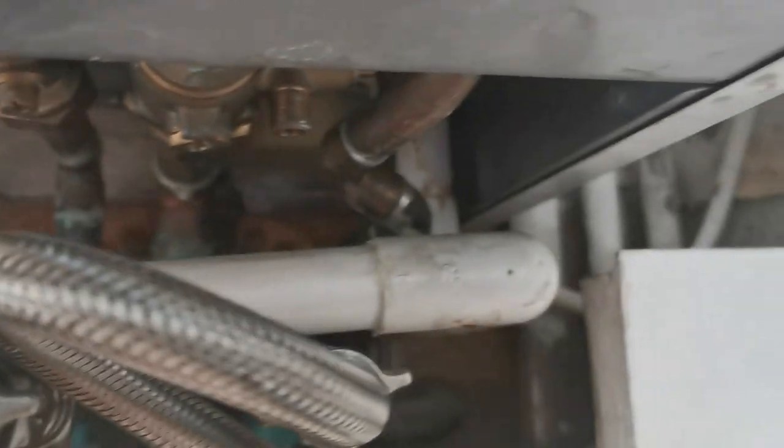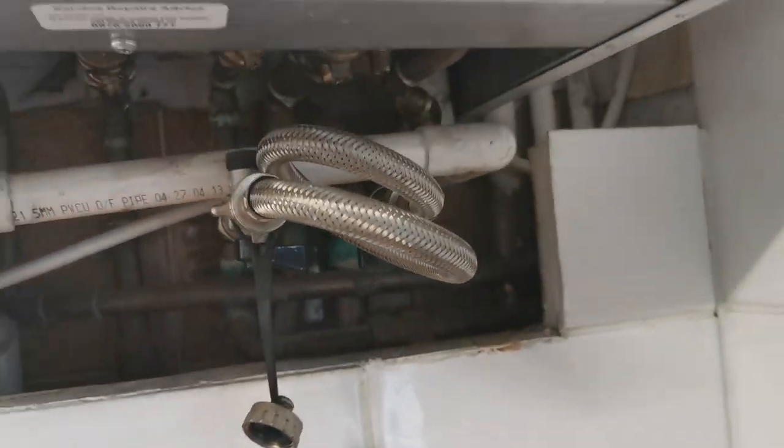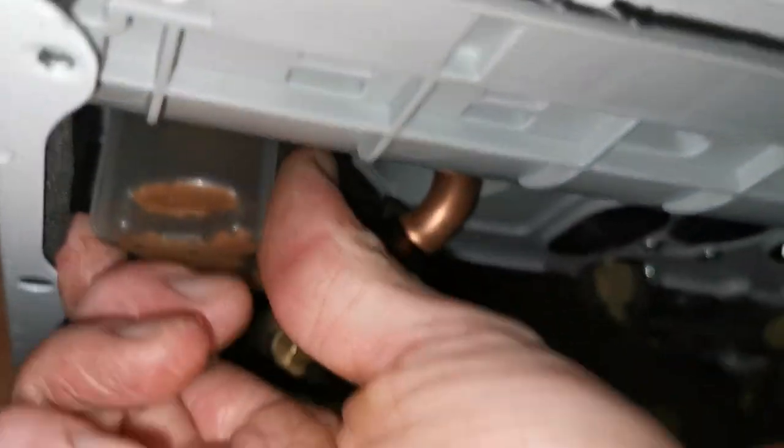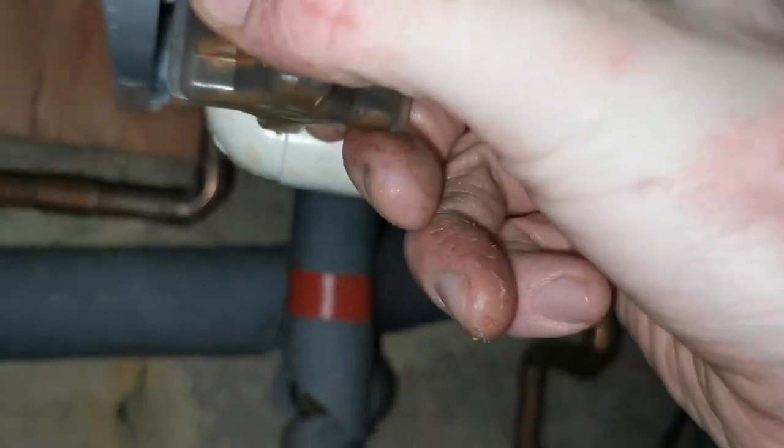Clean up your electrode, or if not, replace it. After you've cleaned the heat exchanger you want to clean the trap. On this one of the models I was working on, it was completely boxed in - the pipework is covering it and I couldn't actually get to the trap. So I've notified the owner and he's going to sort that out.